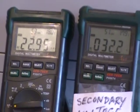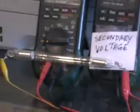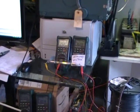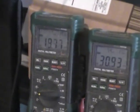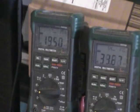Okay, now once we've lit, we got a fairly constant repetition rate. We can see now the back coil is receiving more amperage proportionally than what it used to. We tone that up just a hair more. Our voltage across the bulb is a flickering 300 volts now.